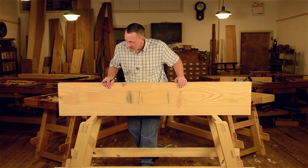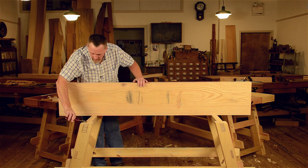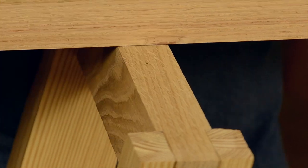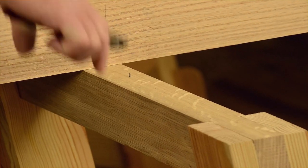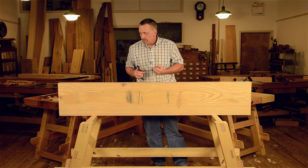We've got our little bit of overhang there and our marks are pretty well lined up. Now we're going to carefully pull our little scrap pieces out and set it down on the nails. Make sure we've got a little bit of overhang there — same thing on this end. What I usually do is take your mallet and give the bottom of the top stretcher a couple good taps and you'll see the top move down on those nails. Now just pick it back up and you can see where our nails contacted the top. So now we know exactly — when we bore our dowels in these locations, they will align perfectly. And that's called blind pegging. It's pretty useful for some things; it really works well here. It's the best way I know of to line them up. After that, just take your cutters and pull the little nails out.